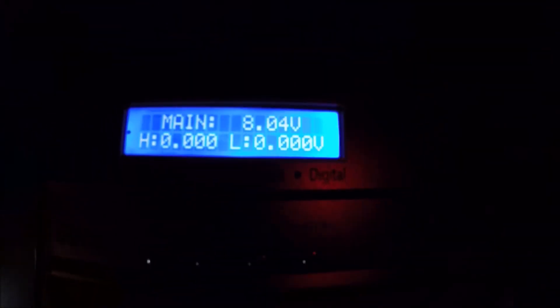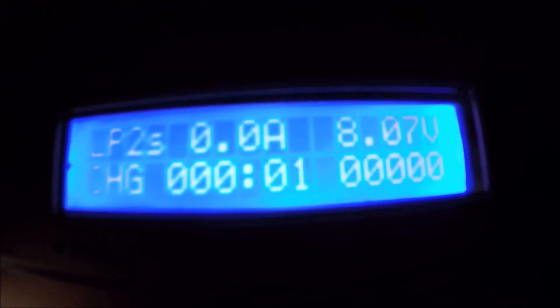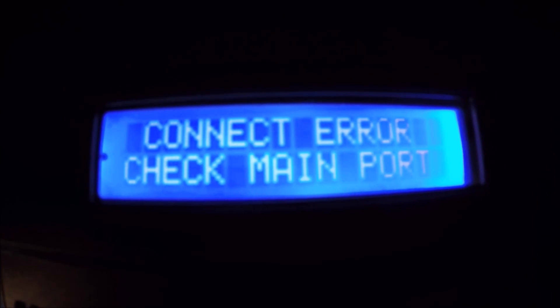Just to show you here, that's the voltage — it's sitting at 8.03, 8.04. Maybe I'm gonna try to charge it up on this. I don't know that I'll be able to get it up to the voltage it wants at 7.6, but we'll see. We got the LiPo charger — charging at 0.8 amps, hit start, battery check, all good to go. Watch — it's going up pretty high pretty quick. I shouldn't be doing that — bam, connection error.